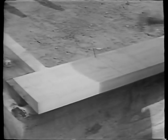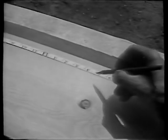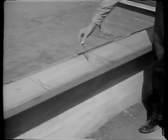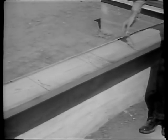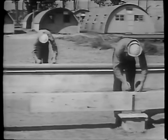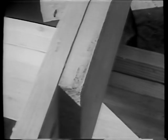We drive a nail at this point, hook on the tape, and starting from there, we lay out the rest of them. In doing this, you'll notice that the marks fall in rotation on the four-inch, eight-inch, and even foot marks of the tape. Where the plans show a partition on the first floor, the joists are doubled in the same manner as at the end of the building. Remember that this does not change the spacing of the floor joists, which fall before and after the partition. The header on the opposite side of the building and the girder are laid out in a similar manner to the first header. Notice that no X's are placed on the girder, since the joists are lapped; due to this lapping, the layout on the other side of the building will be offset by the thickness of one joist.